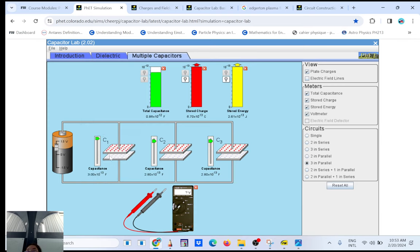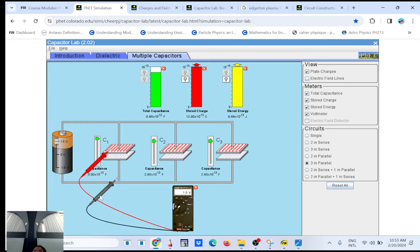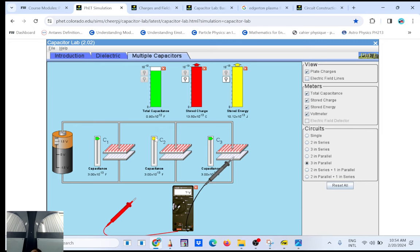What do you think the voltage across is? It's going to be the same, because you remember, voltage is like height. So here, you go from 1.5 to, imagine this is zero. So it means each coulomb of charge has an energy of 1.5 joule relative to the negative electrode. So here you have 1.5, and here you're going to have 1.5, and here you're going to have 1.5. Let's say they have the same capacitance and they have the same voltage. So what does it mean? What else is going to be the same? Same voltage, same capacitance. Very good, same charge.